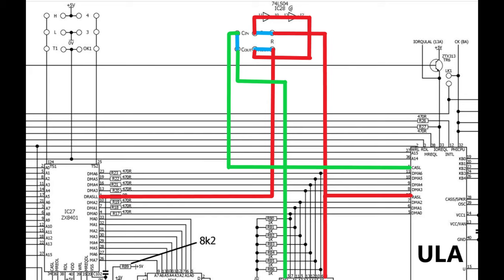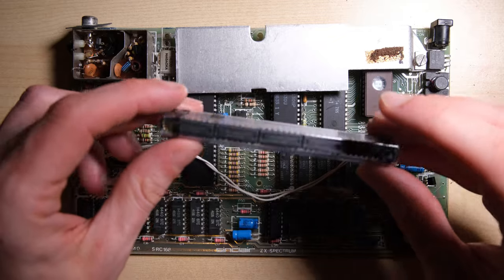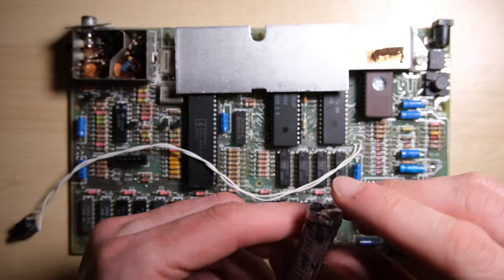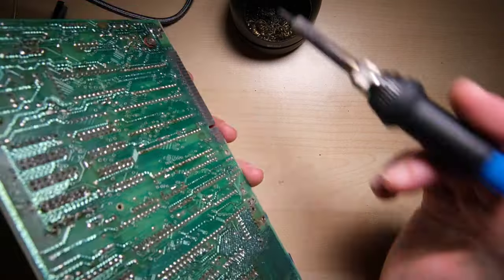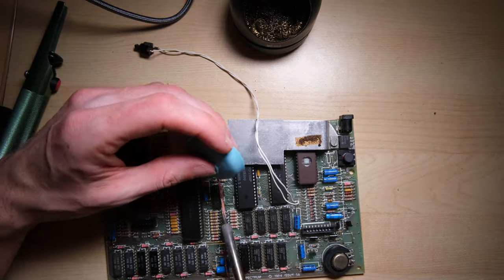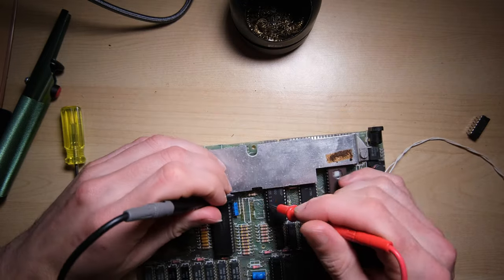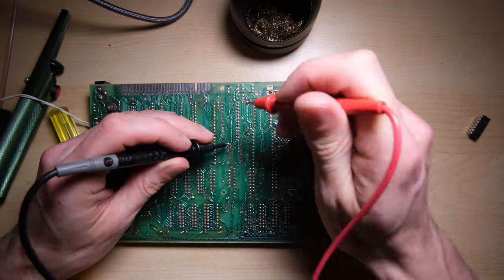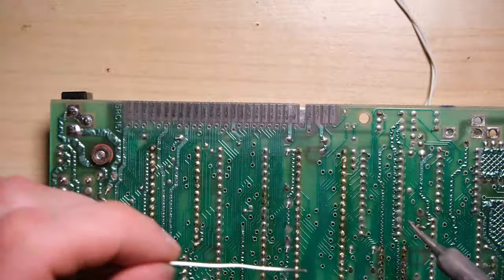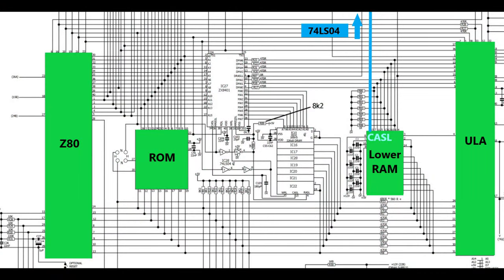As I'm running out of ideas, I'm going to replace that 74LS04 chip anyway and see if it makes a difference. This wasn't as easy to get hold of as the replacement upper memory chip, but I found some and ordered a few just in case. I had to do a lot of poking around the legs of this chip - got the copper braid out again to soak up excess solder, and just had to really work it for a lot longer than the other chips before it finally came out. I visually checked the continuity from the joints to the surrounding traces on both sides of the board. So did it work? No.